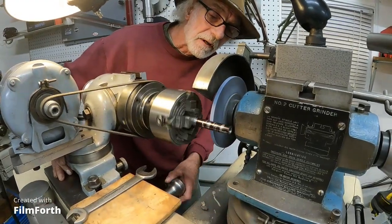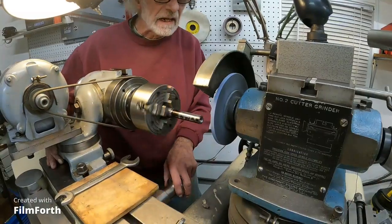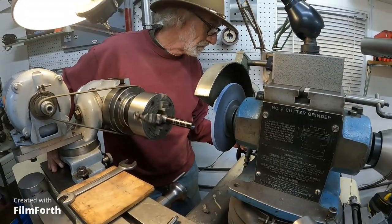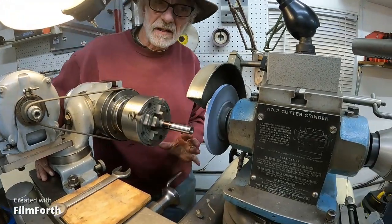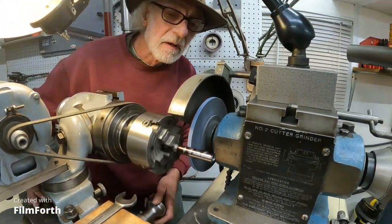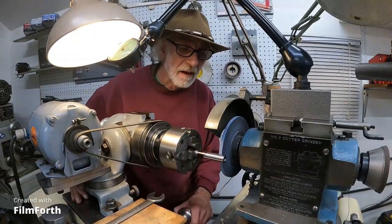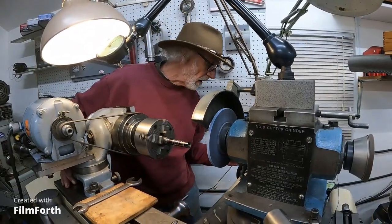Right to the end — that's pretty good. Let's do it through the middle. That's three thou. I'm going to put it in the middle of the stroke. Of course, that takes the double off the diameter. So that takes two thou off the diameter. That's a big cut, man. Get it on the other one more.